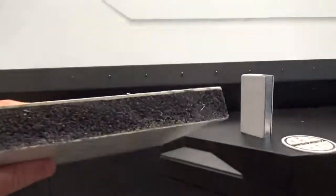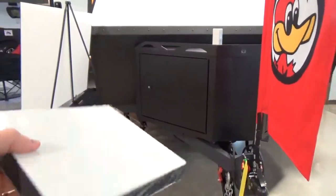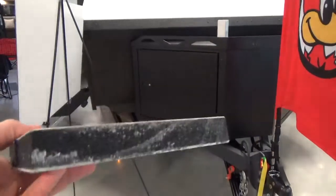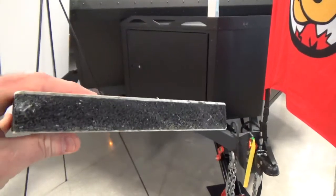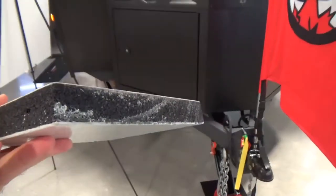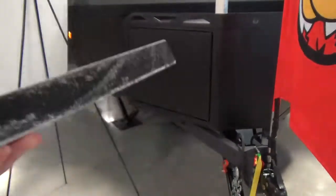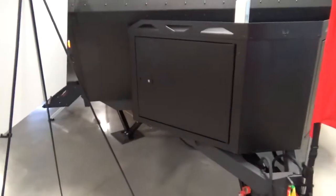This is called Transcore. Unlike other composite built products, floors in the industry that are in some cases a honeycomb type floor which have zero screw retention, that's why you don't see table legs and stuff screwed into floors. This Transcore, friends, is unbelievably lightweight, but very, very strong, and it's got fantastic screw retention. Okay, much like plywood or even better. And what's really neat about this is that you could almost submerge this in water for like 10 years and it's gonna stay the exact same. The beautiful part about that is you don't have to worry about your floor rotting out on you.